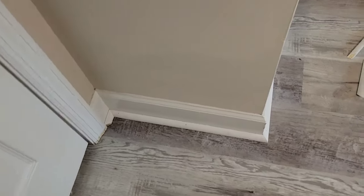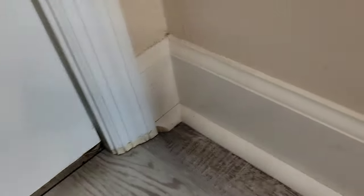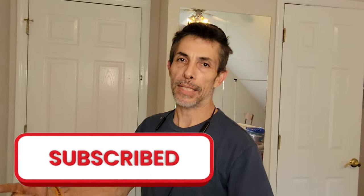There's the finished product — inside corner and outside corner, 46 and 44, with returns. All I have to do now is cope that top line and fill in the nail holes. I hope we finally got this sorted out: where to start your measurement, where to stop. If you enjoyed today's video, smash that like button to help get it out to others with the same questions. Hit subscribe and turn on notifications to be part of DIY nation. That's all for this one — take care and stay safe, peace.